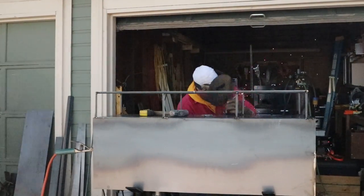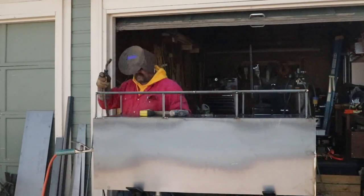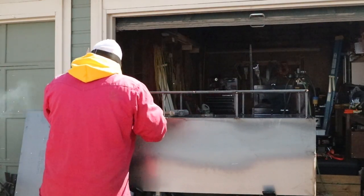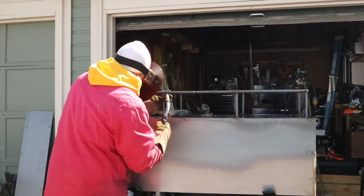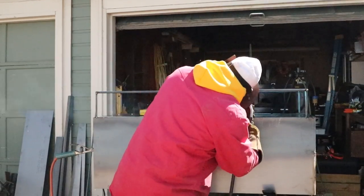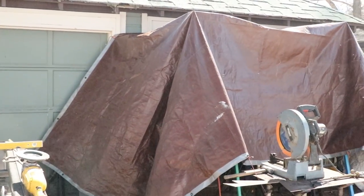Now, like I said in the beginning of this video, one thing I love about having oxygen bottles laid flat on your truck is you can actually start building on top of them. The main box above it is for your levels and umbrellas and things like that, just to where nobody can get to them. You can add a lock to it if you want to, or whatever else if you're that worried about it. But right here, you can see that we're actually adding cold roll, which is going to be framed off, and this is for where your cooler is going to sit. It's going to be kind of an extra rack on top of the oxygen rack so that you can add your coolers, or strap something down, or put a chop saw or something like that on top of your oxygen rack.